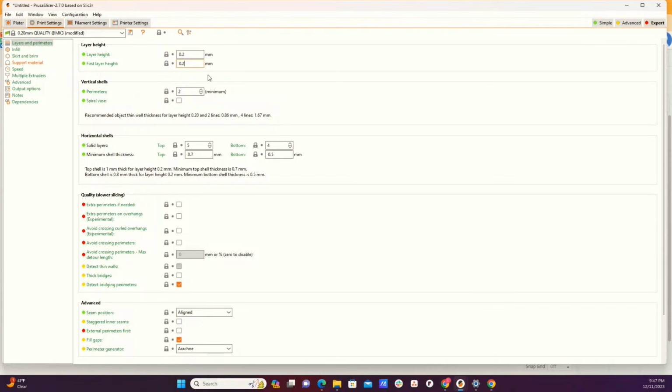1.5 is maybe the thinnest I would go, but I know other people have done thinner and seen some okay results with it. But again, with 3D printing, sometimes it requires a test model. You print the test model and verify that it looks good, and then you can print more. And the more you do it, the better you get at understanding what to do.